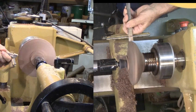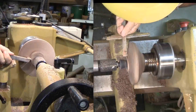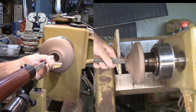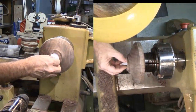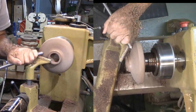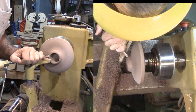So now I've remounted it with the tenon on the top. I'll trim the bottom tenon round again and smooth out some of the exterior. I could have reversed it, but the tenon walls on the top tenon were already quite thin. I'm using a square carbide scraper for this portion. Next, I'll clean up the recess for the tea light — this is why I had switched to the square carbide. Then refine the OG shape I had started earlier. This is blind turning: with the interior totally enclosed, I cannot stop and re-measure my wall thickness. But I know I have enough wood at the top of the OG curve to pull it in closer to the tea light. I tried to put a bead at the top next to the tea light recess, but this chipped away, so I'm on plan B.